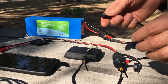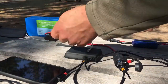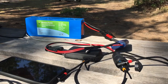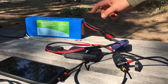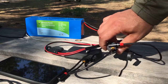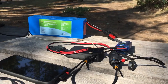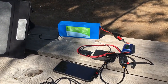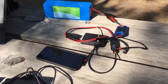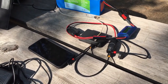I can plug everything in and connect it all to the output of the battery even while the battery is being charged. Some devices don't like intermittent connections when charging, so this setup gives the charger a constant supply of energy from the battery, and the battery gets charged from the solar as the sun permits. As branches pass over or not, the battery doesn't care — it soaks up electricity when it can, while reliably charging all electronics that require a constant, predictable voltage.